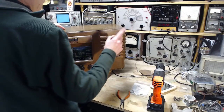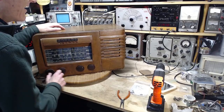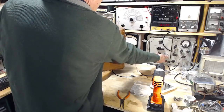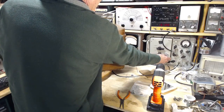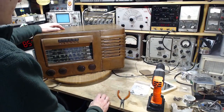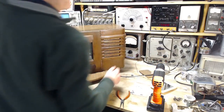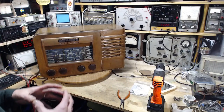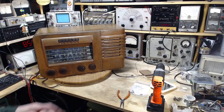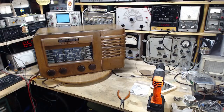I did something dumb here. Let's go back up - a little bit confused. 15 is where I want to be down here. Wow, it's receiving really good - it's receiving everything, it's fantastic. So this makes me think there's all kinds of stuff going on in the detector tube. Lots of signals in there, all getting mixed up with each other, and maybe even getting fed around and back in again to come through for another run, generating all those 455 kHz components we could hear there.